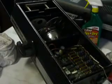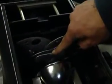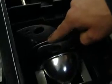Now don't let it fall into the circuit board, you don't want to damage it, so let it hang to the outside. Now when you look through the Trackspot here, this is a thermal infrared reflector. Here you have a shutter, here's your color gobo wheel, or your color wheel, here's your gobo wheel, you've got your focusing lens, and then you've got your final lens.